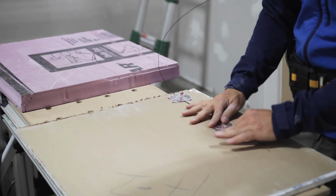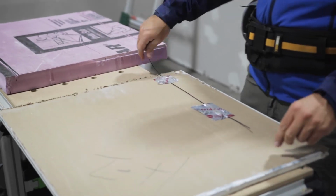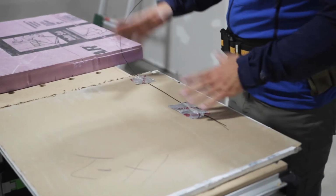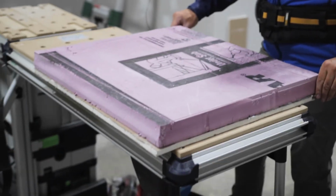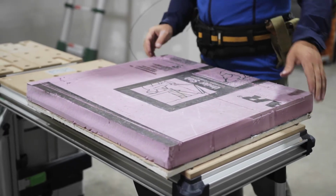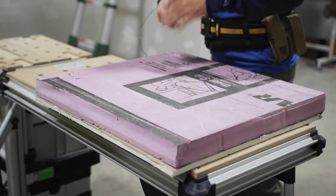Mechanically fastened. We used to use screws and eye bolts, little tiny eye bolts with screws. Put your wire on, go all the way around, thread it through, tie it up. Staple will just, because typically once we leave this attic, no one will ever get in it again, except for the cable person and the TV person. But when they do, they're like a bull in a china shop. They'll kick and throw, and they're not worried about our work, right?